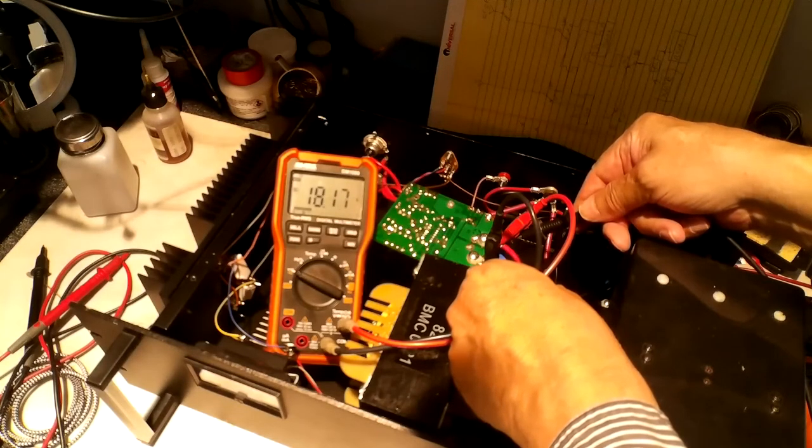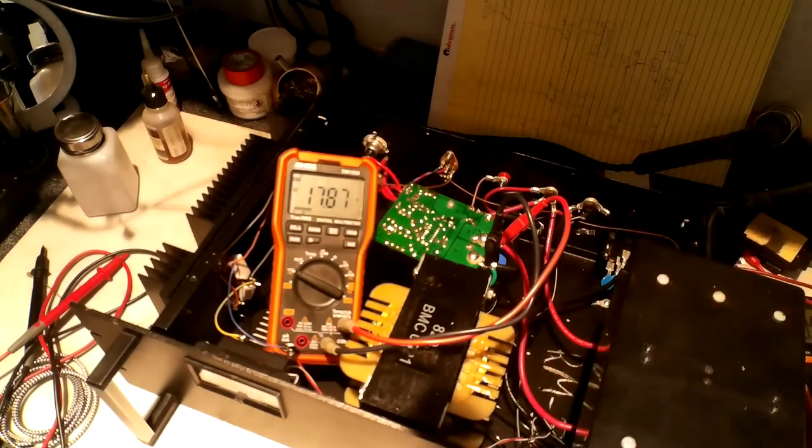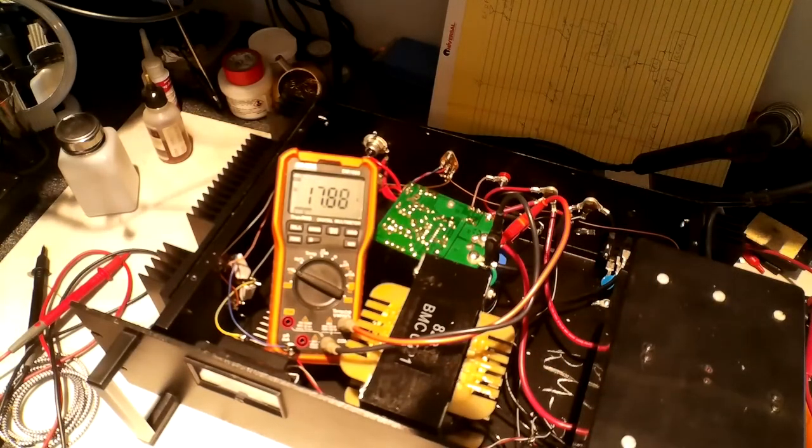Okay. Well, you probably don't need to see all that, but that gives you an idea. That is a huge capacitor. Now, it's only rated at 50 volts, which is enough to give you a shock. And I'm sure 50 volts at this kind of capacity could be pretty dangerous. It's actually 22 as it comes out of that capacitor, but still, always discharge these things before working on them. And so we're going to go outside and see the rest of this.